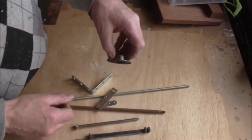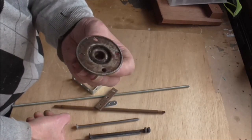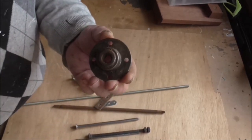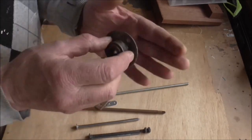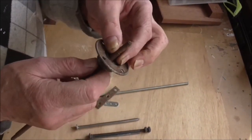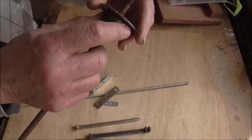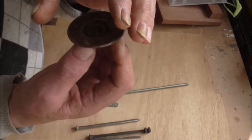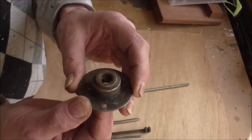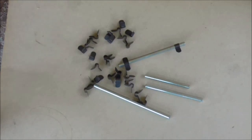You just put two screws in and the rod comes out through there, acting as a bearing surface. Another way I've done it — this is a bit elaborate — is using a ball bearing out of an old Hoover Junior motor. It's got a decent ball bearing inside and four useful holes. I screwed it to the bottom of the whirly gig, found a rod that fitted perfectly, and riveted or nutted the end over, so it acts as a nice ball bearing and the thing spins nicely in the wind. It works well, but it was a bit fiddly, and I'm not sure I'd do another one.